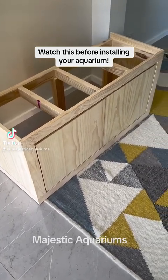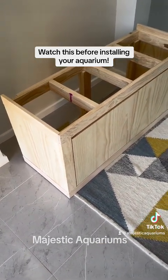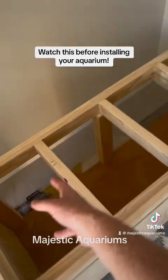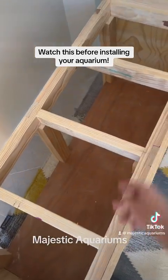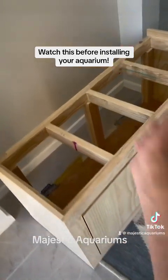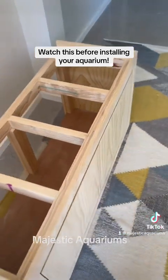When you get a new aquarium cabinet like this, it's really good to give it a good stain, gloss, or whatever you want to do — make sure it's waterproof using a waterproof sealant. Don't just stain the visible bits. It's quite common that I'll go to a job and they've beautifully stained the visual surfaces but not the rest. Over time, even treated timber will deteriorate if water from your filter gets on it, especially with salt water. Give it a thorough 360-degree stain, even turning it upside down and staining underneath.